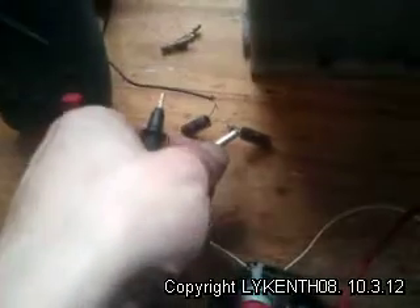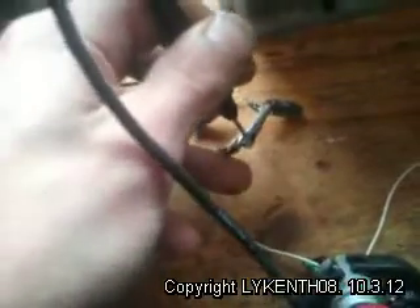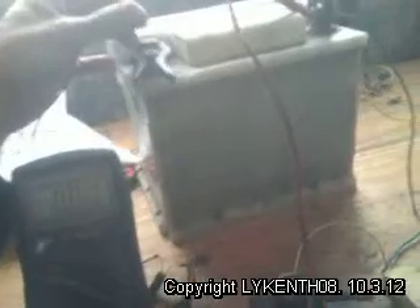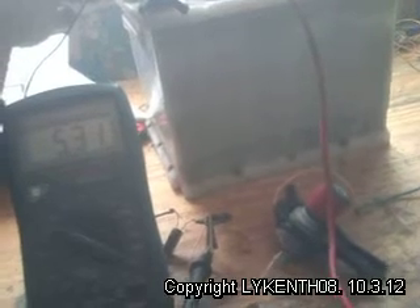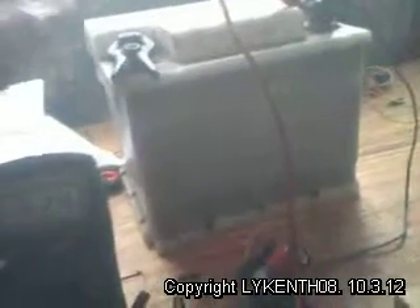I'm going to put the positive back up there. The positive is fitted in, and I'm going to connect the multimeter now to the output of this capacitive step-down transformer, so it will show the voltage going across the motor. I'm going to connect the negative — sorry about the glare. As you can see, it's only roughly about 5.28 to 7 volts.